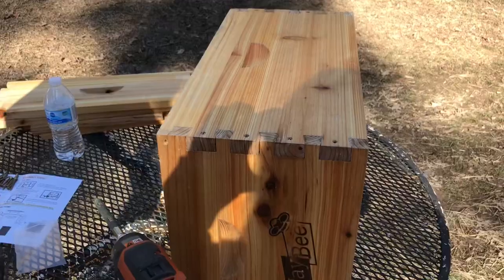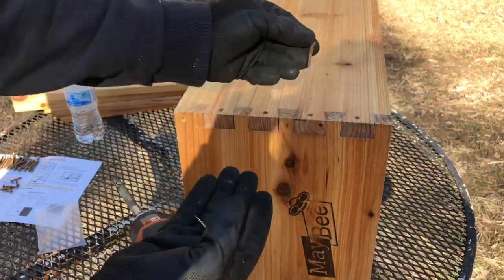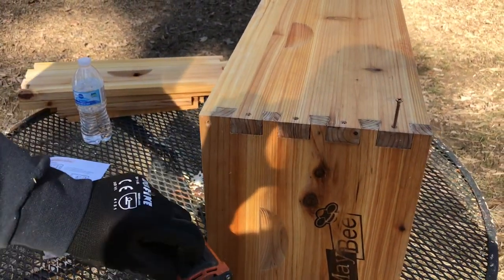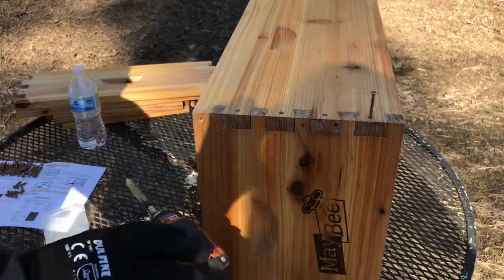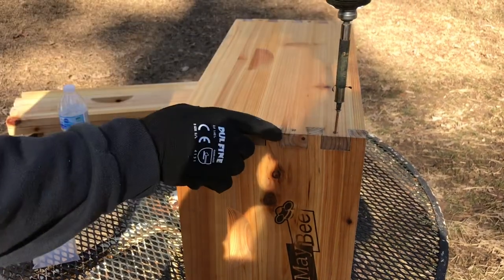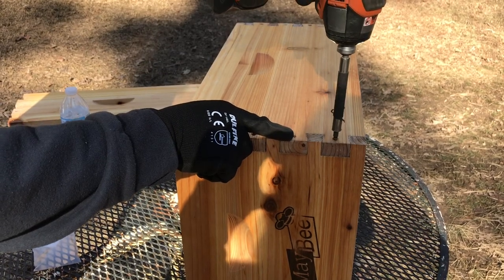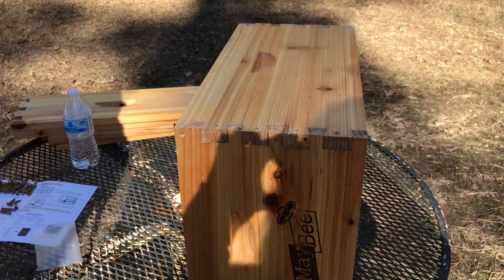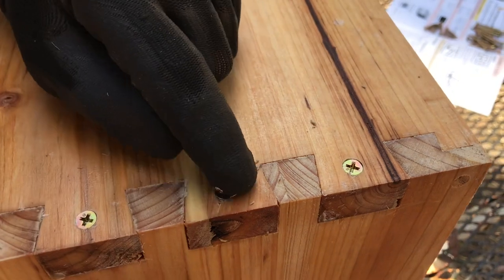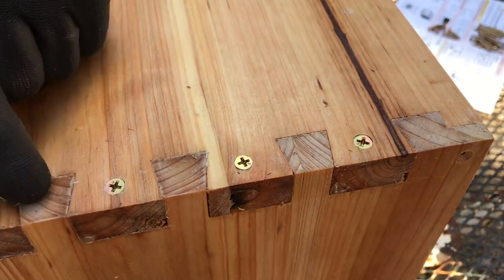And now we'll put the screws in. You've got two different length screws with the kit: a long screw that goes in the sides, and a short screw that goes in here. Turn your impact gun or drill chuck down if you're using a power tool. Make sure your box is snugly together first before you put the screw in — make sure it's straight, plumb — and then just ease into it. Don't countersink them, you could bust the wood. Just make them flush with the edge of the wood. There's a pre-machined spot in the wood so you can take the head of the screw and just flush it off, and you should be in good shape.